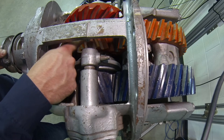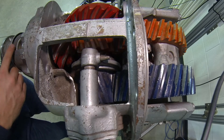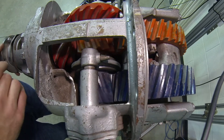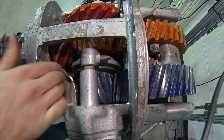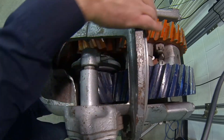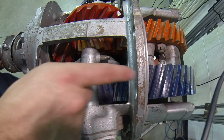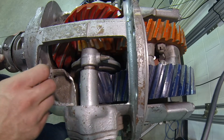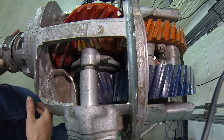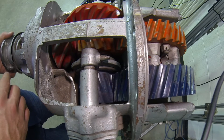One is an orange helical gear right here driving the orange driven gear, and the blue drive gear driving the blue driven gear. The blue drive gear is smaller than the orange drive gear, and the blue driven gear is larger than the orange driven gear. The blue is first speed, or the lowest speed, and orange is the high speed, or the second speed of this differential.